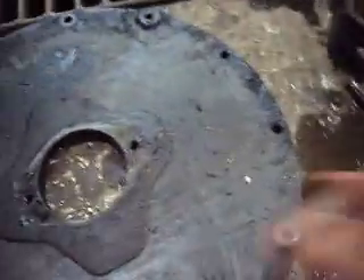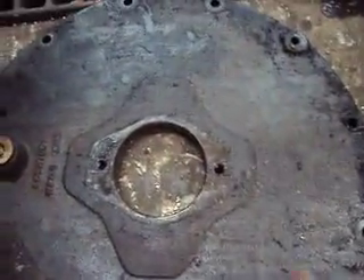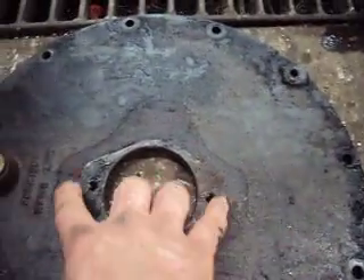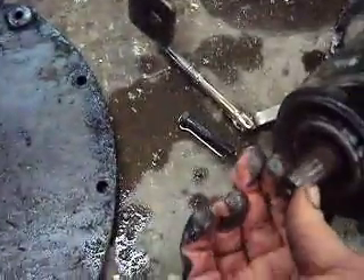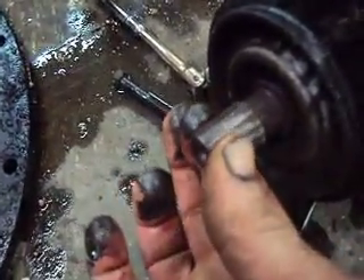When I first looked in here, I noticed that the whole pump assembly was loose. The pump assembly bolts onto this, which bolts onto the back of the engine - kind of like your flywheel housing cover. What I noticed is that these two bolts were gone, and things were in there kind of loose. When you run something loose like that, the input shaft for the pump - you'll notice that there are no splines left on it. And this is the drive plate that bolts to the flywheel, and it's pretty much the same thing - no grip there whatsoever. We can just take this and spin it on there.